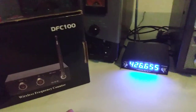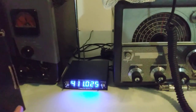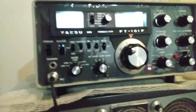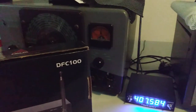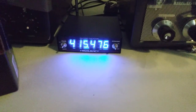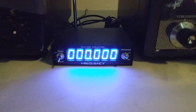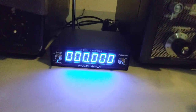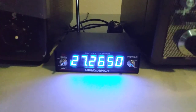So I've got some of these in right now — I can sell them to you guys. Of course you can buy them online, buy them on eBay, I think they sell them on eBay, but I did get a bunch of them in and I like them a lot. I use it with my Ranger. The Yaesu doesn't really drift — you don't really have to worry about it, it's gonna be right there almost dead-on, turn it off, turn it back on. But the old boat anchors like the Johnson Ranger sitting behind it, they will drift a little bit if you're not careful. You can also turn it to bypass antenna mode and you can see I key up and nothing happens, then turn it back to antenna mode and it picks up the antenna fine, dead on frequency.